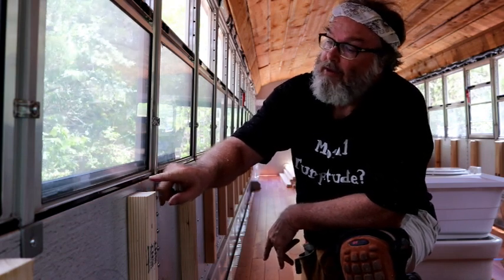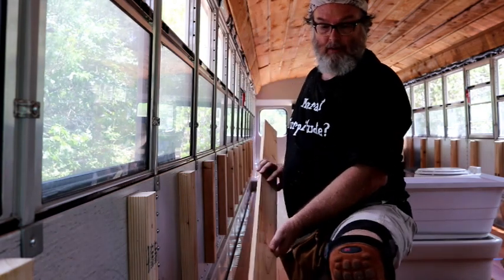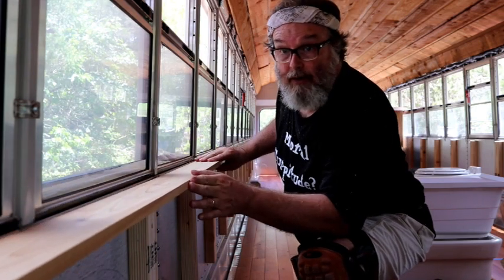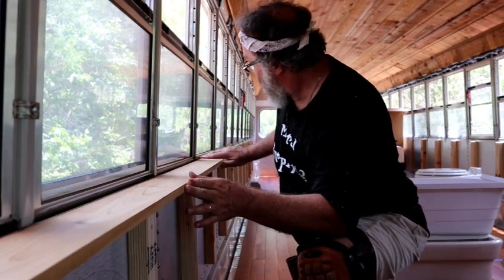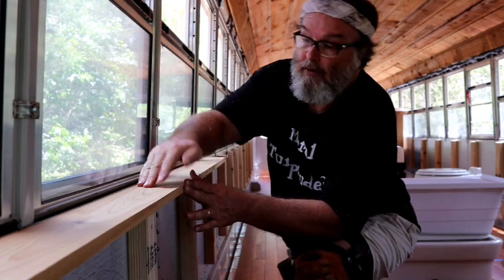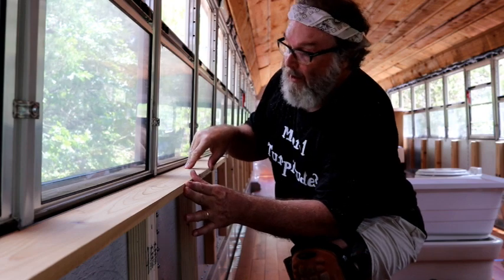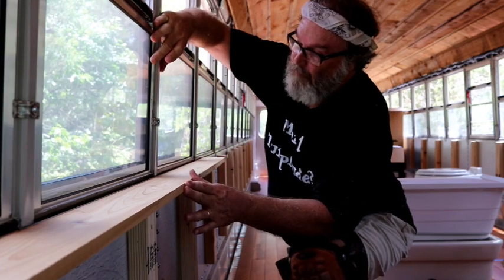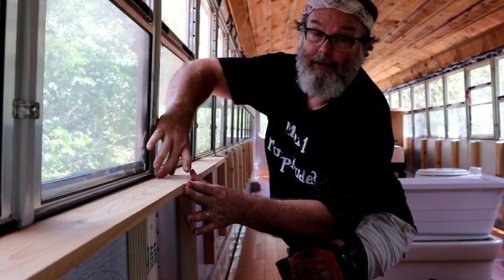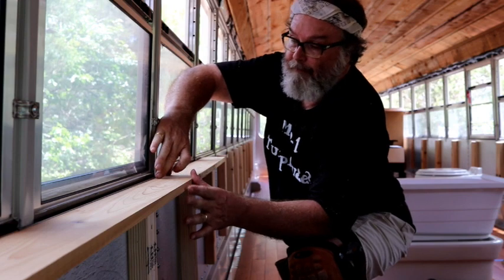from the steel windowsill. We're going to take planed and sanded cedar, 1x4 cedar, set it on the tops of these nailers. They're all at exactly the same elevation. Put two screws into each nailer. And then at the window post, go ahead and case in the windows and then butt the casing into the windowsills just like a normal home window.